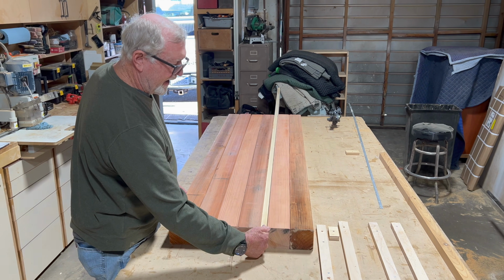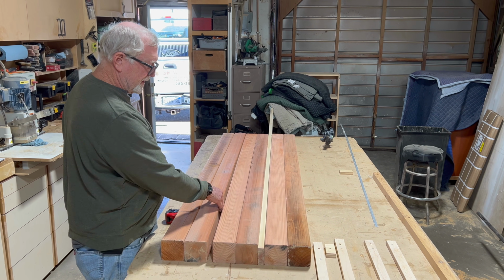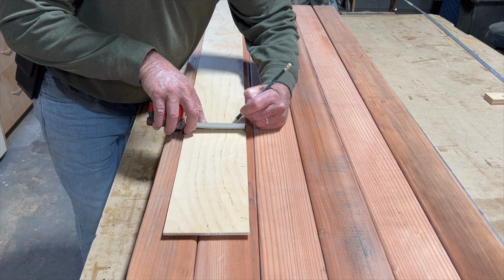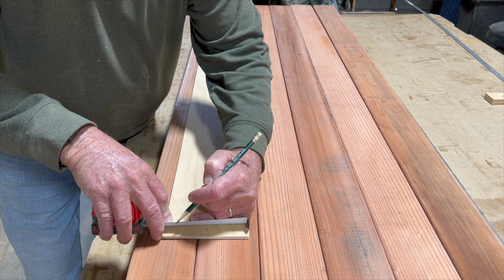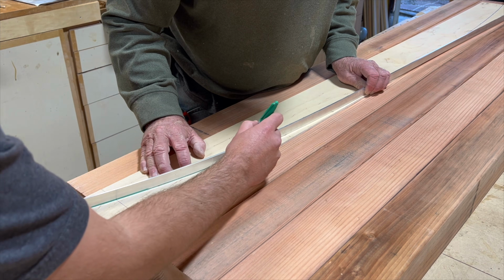So I'm gonna make a wooden surfboard with my dad. It's his cabinet shop. My dad is a master woodworker and I really wanted to make a wooden surfboard with him. So we dreamt up this 4-stringer redwood surfboard and started building it. We started with 6 4x4s of redwood and built a rocker template to put rocker into them.